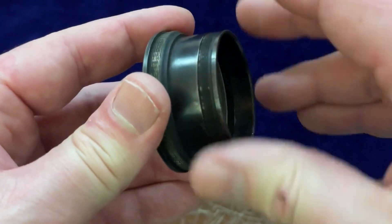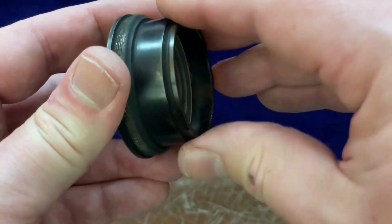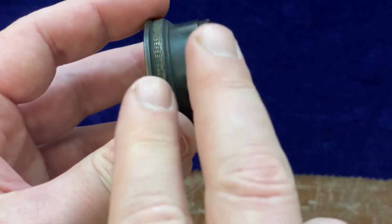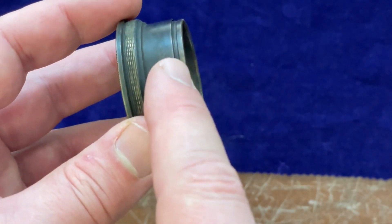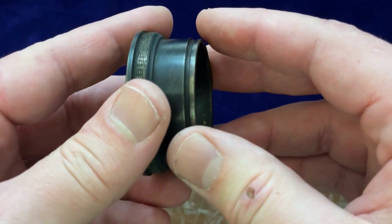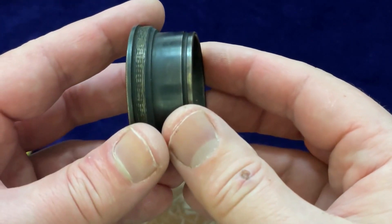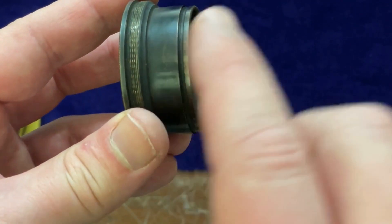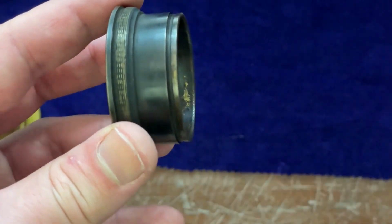So this is the optical layout, the standard layout. There is also a slightly altered layout by Dallmeyer. Dallmeyer did switch the flint and the crown element in the rear, so the flint was actually in the back and the crown was inside. But usually Dallmeyer lenses and most of the makers which adopted this layout used cased elements, meaning the elements are attached to the metal parts. So you might unscrew both parts, but you cannot actually take out the glass that easily.